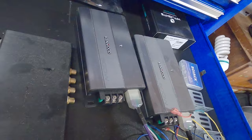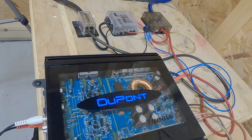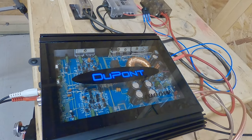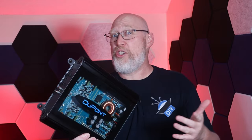It's not uncommon for an amp to emit a high-frequency whine — a lot of Class D amps do that right at clipping. Some amps I've run for years in my truck whined when the gain was cranked all the way up and we had distortion or clipping. But this amp started whining almost as soon as I started playing the 1 kHz test tone. I'm not an amp technician, so maybe that whining was a side effect of playing test tones, but I've never had an amp whine like that. My job is to give you an honest report of what I see and hear, and you can do whatever you want with that information.